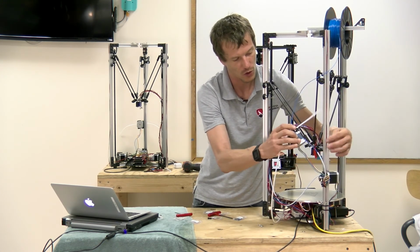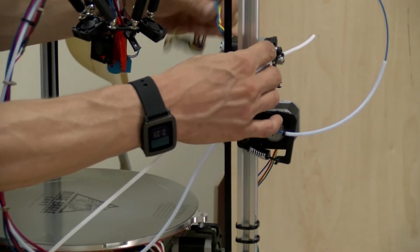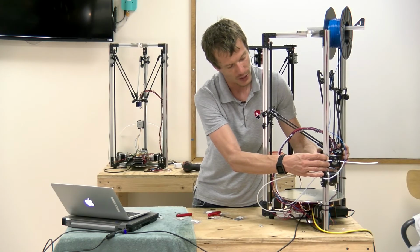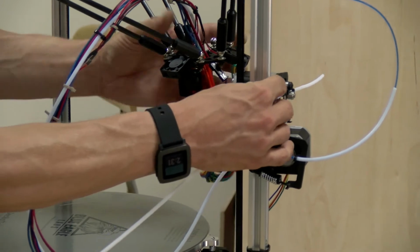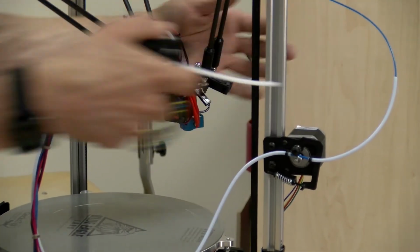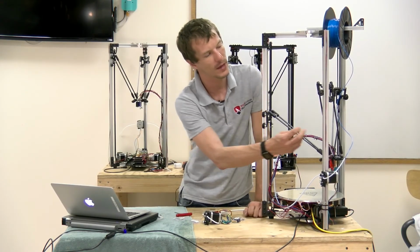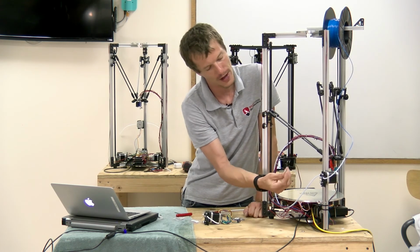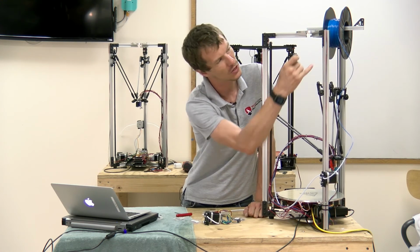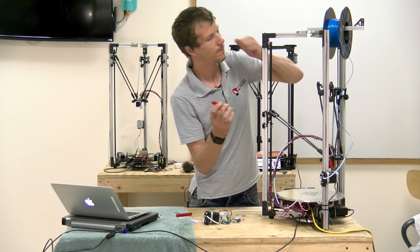We actually had ours on this way, and it seemed like it was giving enough clearance, but occasionally the fan would catch when it was printing at the very outside of the bed, so we had to reverse it. Seems pretty safe here. Unfortunately, if you didn't have the foresight to drop them in on the initial assembly of the frame, you're going to have to get some of these T-slot inserts into the inside track here, which isn't too difficult if you've forgotten.